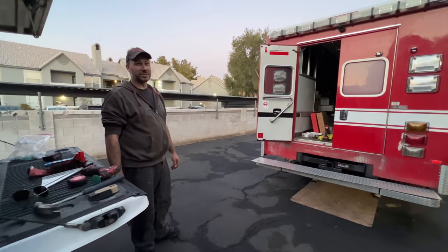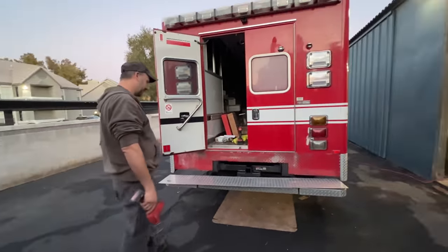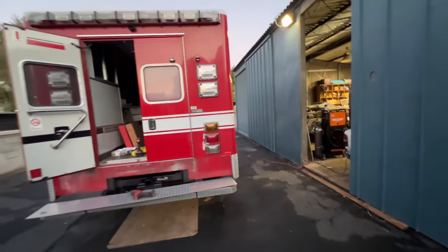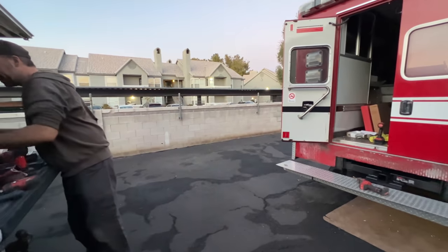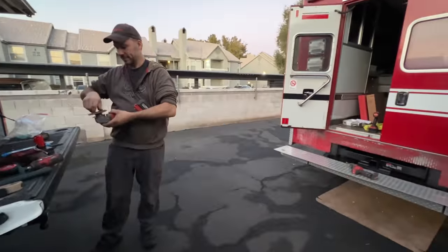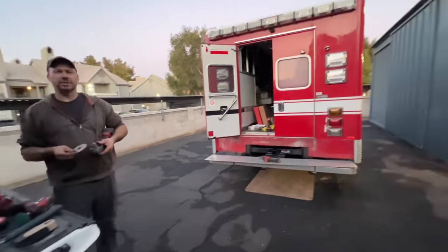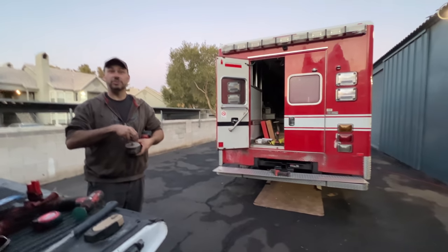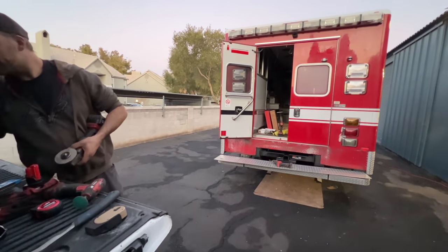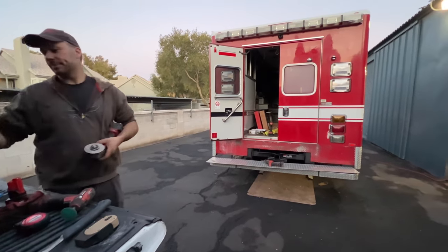Wire was about 29 dollars a roll. Have you ever used the Chicago Electric welders? Those little 110 units are fine for fixing a fence or light work. This Vulcan 220 is a 220 volt full-blown welder. Where it fails is duty cycle — if you were trying to run a shop on it, no. But for occasional use it's fine. One feature I like is the adjustable post flow. My other welder can do spool feed, TIG, MIG, and has a foot pedal — it does everything. This one does everything just a little bit.